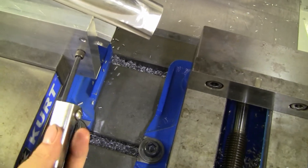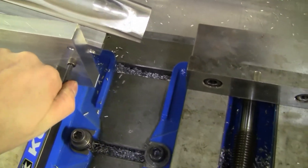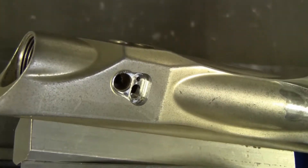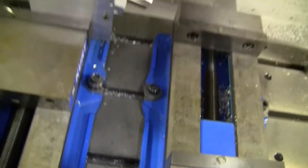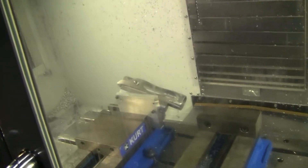What the program is going to do is take an end mill and come down and create a small starter hole that goes down through there, and then the actual drill will come down and finish the hole all the way down in the middle. I found out I had to use a starter hole to get everything right. I'm going to have to slow everything down in order to make sure the program works without coolant.